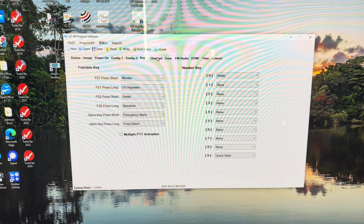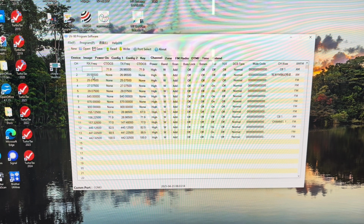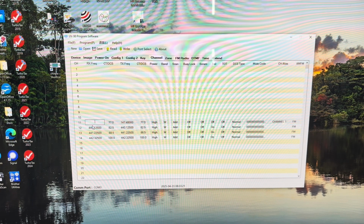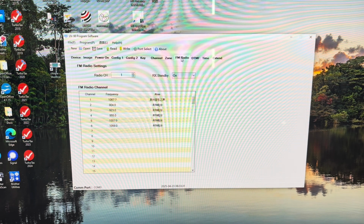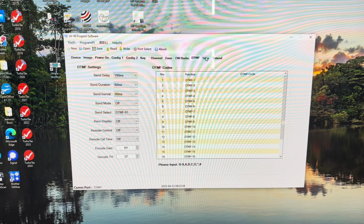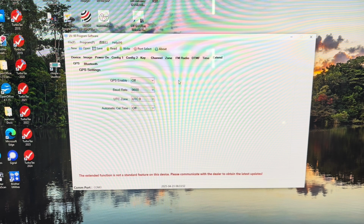Okay, now we've got our channels. These have been put in by the CPS software, so I'm going to clear all those out. Zones, I'm going to change these. The FM radio, I can change the presets for the FM radio, the DTMF codes, and for time, I think most of this is really set for the GPS, which is in the extended, which my radio does not have.